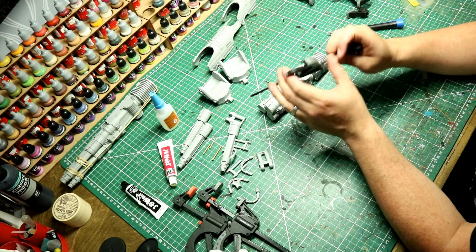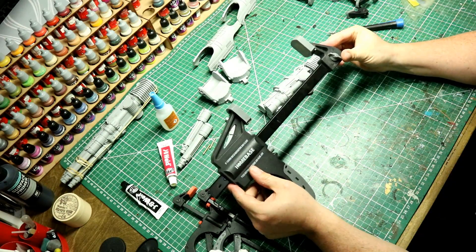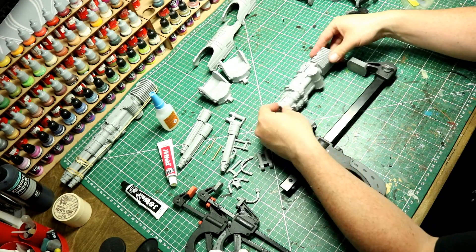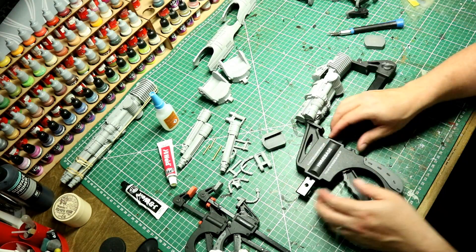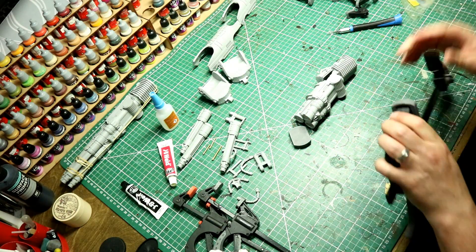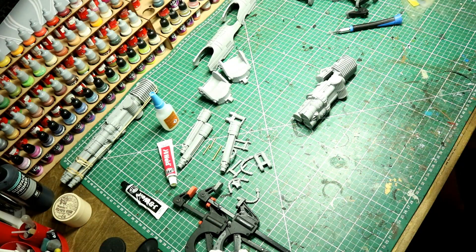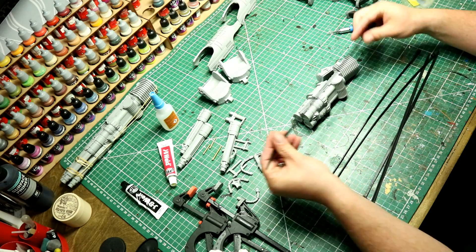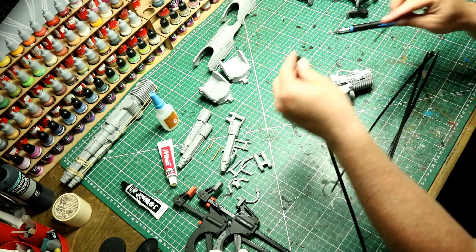These pieces are a little bit wobbly and in order to make sure you compress these together you need to use some clamps - but make sure that the pieces fit first, otherwise you're going to be wandering around holding two pieces of resin together and twiddling your thumbs because none of your devices are going to hold them together. Brainwave time: we come up with the idea of very long zip ties or cable ties, and these seem to be the best way of holding these together.